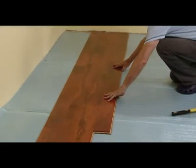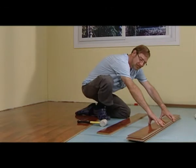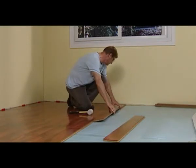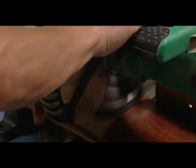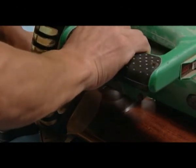Now push the whole unit against the wall and fill in the expansion joint, 8 to 10 mm, with spacer blocks. From the fifth row on, finish off each row at a time, each time joining the panel along its long edge, then along its short edge, and each time tapping as instructed above. You can use the leftover pieces that you have at the end of each row as the beginning panels of the next row. That way, you should make the best possible use of each panel.